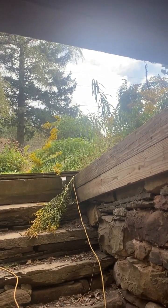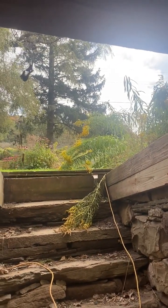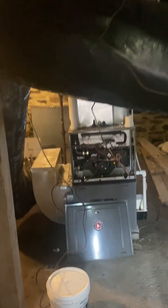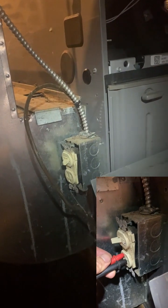We've got a broken heater. Some guests are staying and they said the heater is not working. It's a lovely fall day outside — pretty spooky place down here. I've got this propane heater here and I checked the outlet, plugged in the multimeter, and very strangely it's reading like 20 volts. That to me smells like something like an open neutral.